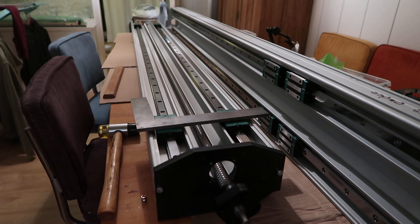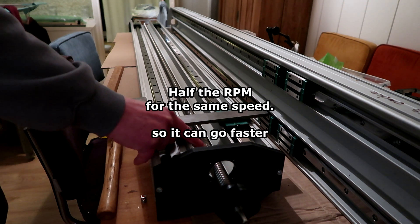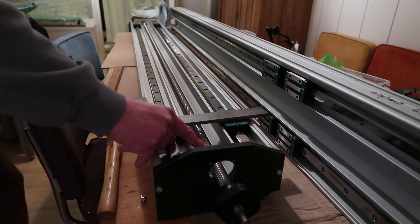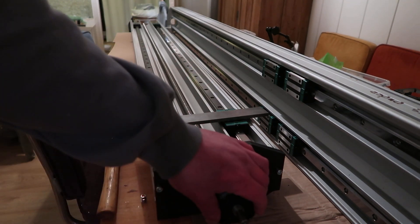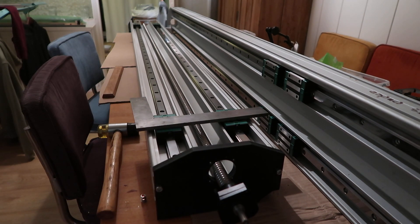The previous ball screws were 20 millimeter pitch, so they turn really slowly. This one needs to turn quite fast to achieve 5,000 millimeters per minute. What are your ideas? Of course the best idea is just to test it — if it doesn't work, change the thing. I'm pretty good at wasting money, that's for sure. I do have a lot of stuff I'm never going to use. See you later!